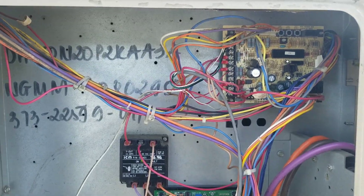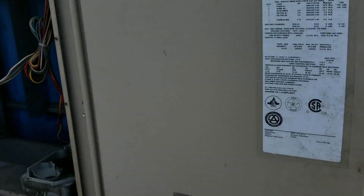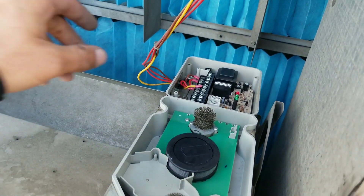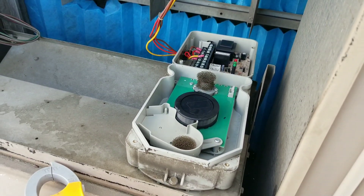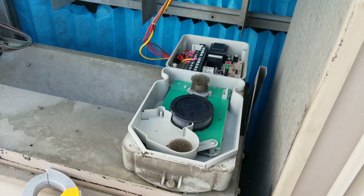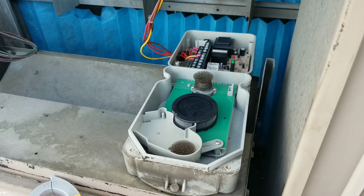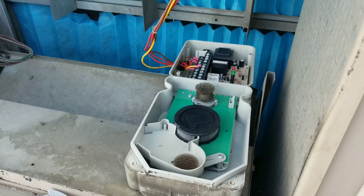So that's my issue — that is the gratification I was hoping for today. I'm going to put the camera down, pull the smoke detector out, inspect the sensing tubes, see if they're clogged, try to reset it, clean them out, and get it up and running.